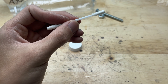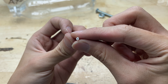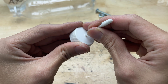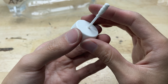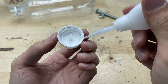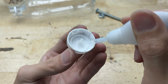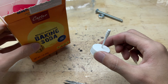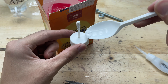After drilling the hole and inserting the cotton swab into the bottle cap — bolts and nuts often have a layer of rust or oxide on their surface. This layer prevents the metal from making direct contact, resulting in weak or non-adherent soldering. This acid will remove it and help them bond firmly during soldering. I'll secure both the cap and swab with a bit of baking soda and super glue.